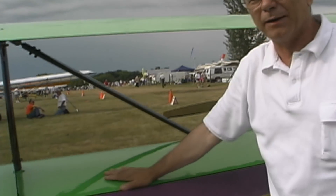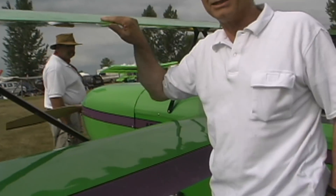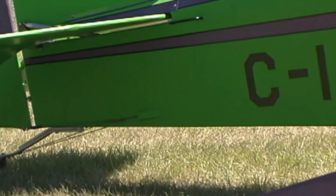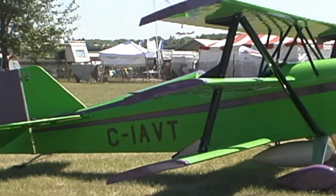So we went from a wood wing, then to an aluminum wing — what's the third stage? This one here has a fiberglass wing. It uses much the same internal construction, but uses a fiberglass sheet glued on the top instead of plywood and fabric covering or aluminum. If you do it right, you get a really smooth finish. The wing is 12% thick but only two feet by eight feet, so you don't need a lot of room to build it. After building two biplane models, we wanted to build a carbon fiber wing to get much higher performance, and we started experimenting with different wing types.